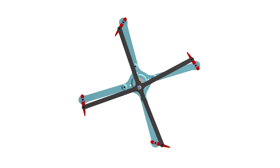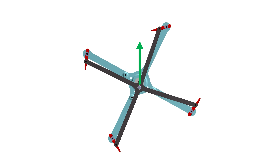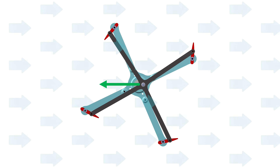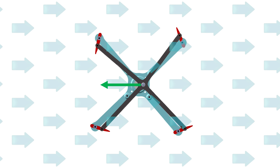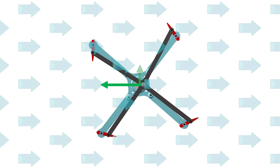A disadvantage of this design is that at two locations around the rotation, the blades are experiencing drag but not producing any useful lift, unlike the blades at the top and the bottom. But if we change the thrust vector to be horizontal and let the rotor accelerate sideways so there's airflow into it like a propeller on an airplane, the leading and trailing blades are still producing a forward thrust force, and the lower advancing blade is now acting like a wing and providing an upward lift force.